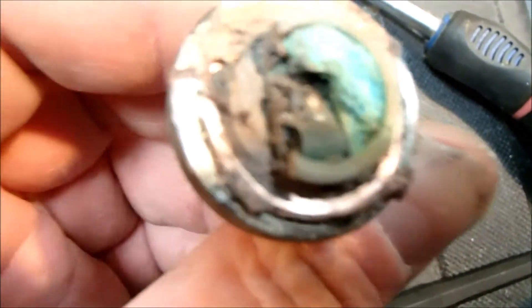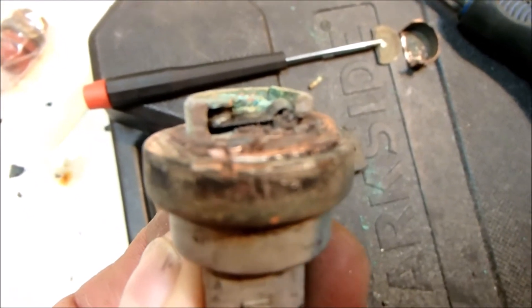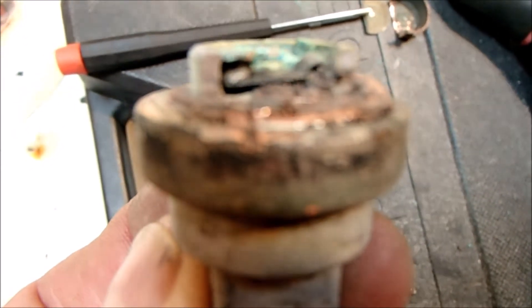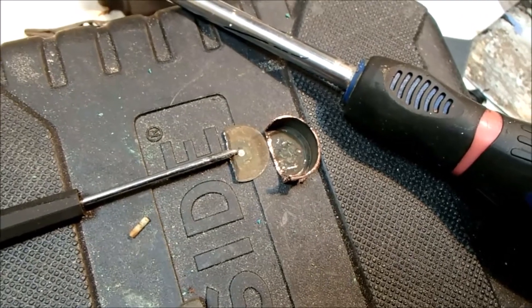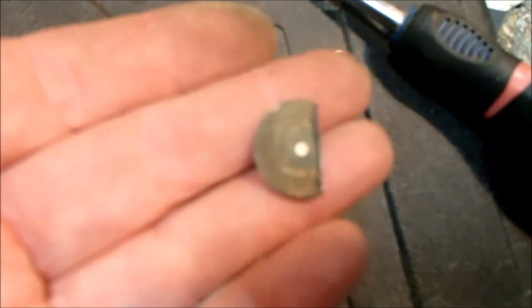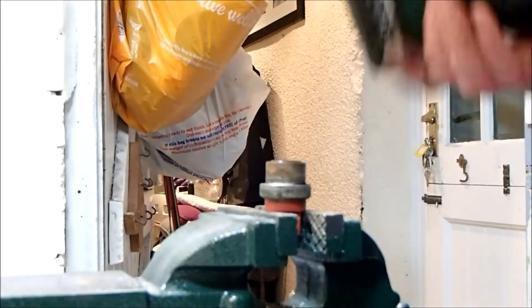The pin pushes a contact open or closed — this is why the switch failed: corrosion, lots of it. Once I've scraped some of the corrosion away, you can see that the switch had failed in the open position, which is why we get no current through it. That seems to be on a spring, so I'm pretty sure that little metal rod expands and contracts. Or possibly the metal plate in there is a disc that expands and pops at a certain temperature. It's possible the disc is shaped so that as it heats up it moves or becomes concave and pushes the switch closed. Or possibly there was wax and it's all leaked out. I'm going to open the other one differently.